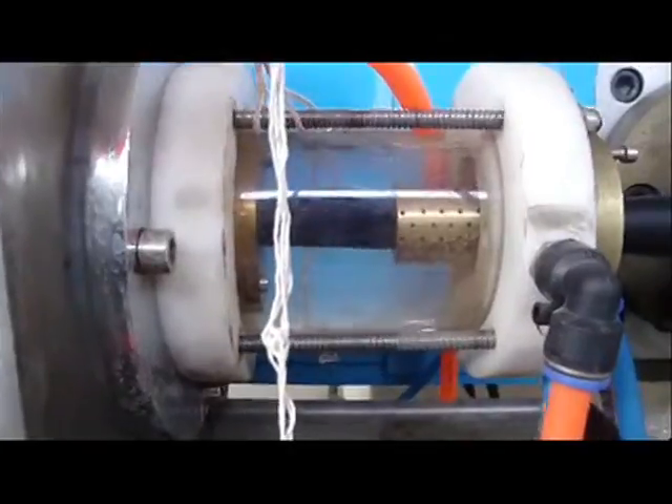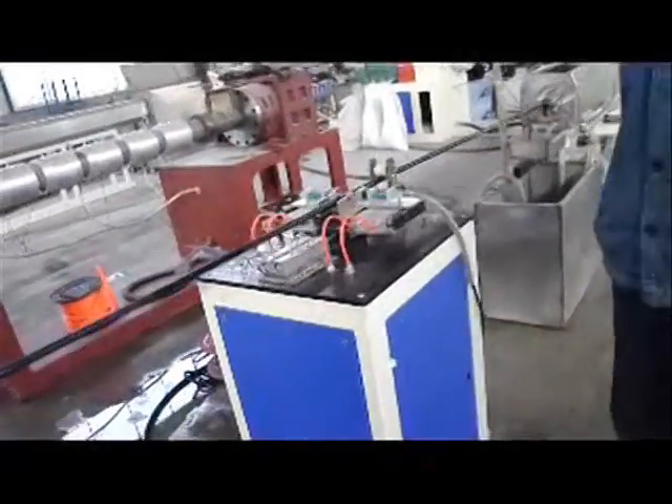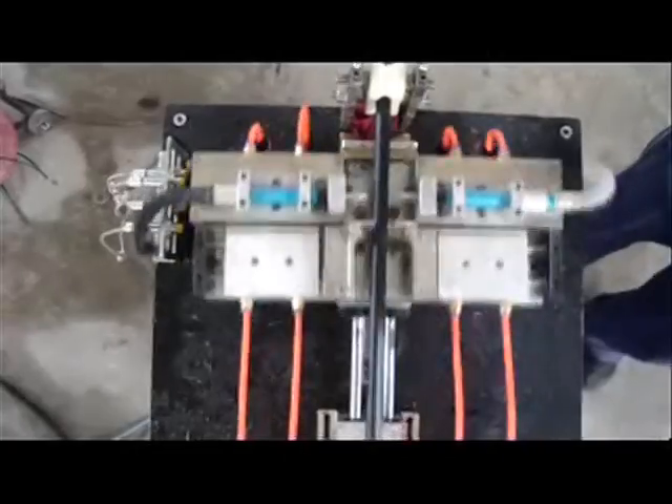The vacuum tank is fitted with a water aquarium bath for precise insertion of the dripper and perfect sizing of the pipe. The drilling machine can make two drills at 180 degrees. The complete drilling process is mechanical and pneumatically operated, capable of 75 to 180 drills maximum per minute.